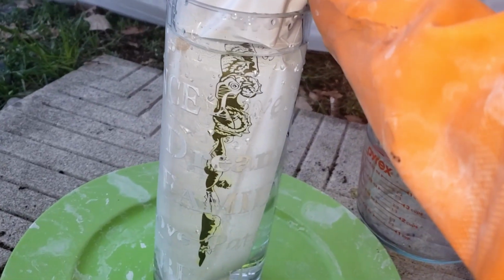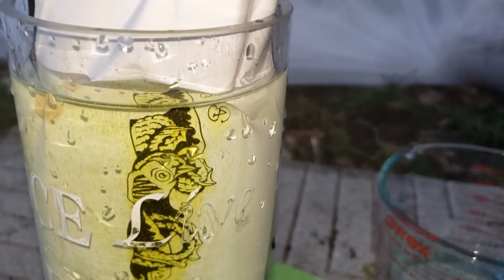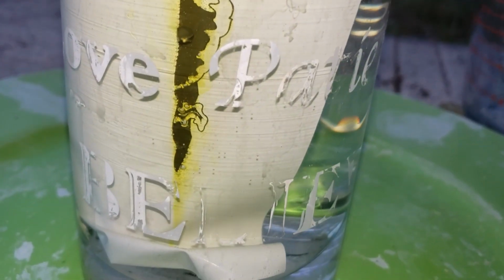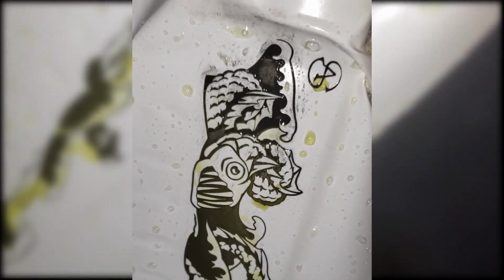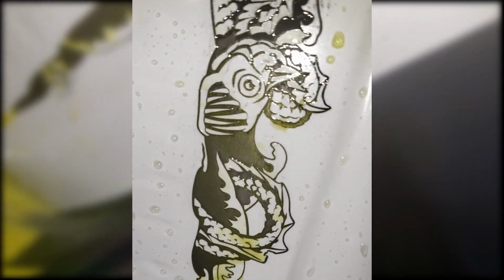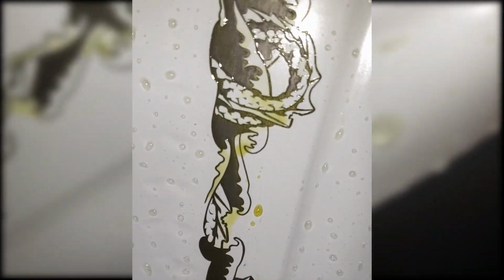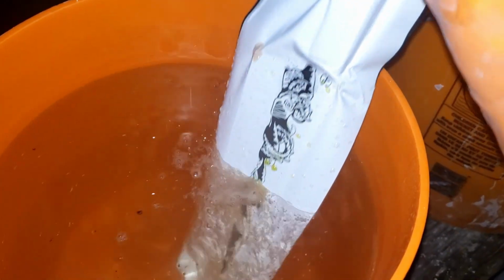I needed a well-ventilated area, so I went outside. And with my acid mix ready to go, I just dipped the blade. The amount of time it needs to spend in the acid bath really depends on the composition of the steel, the temperature of the acid mix, and how much oxygen is dissolved into it. And while I'm learning a lot about that process, the best way to know when it's done is to keep checking it and pulling it out when it looks ready. And once I've hit that point, I'll pull the knife out, neutralize it in baking soda and water, and then move on to cleaning it up.